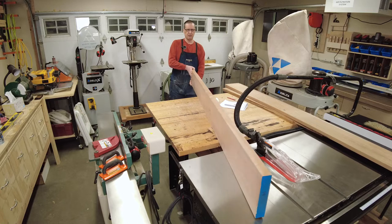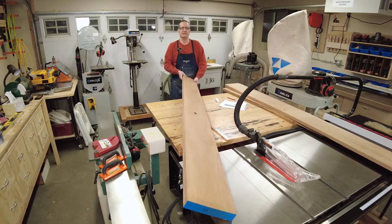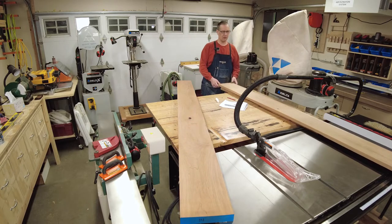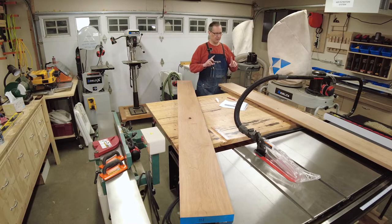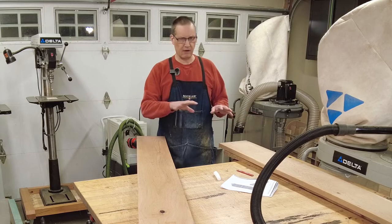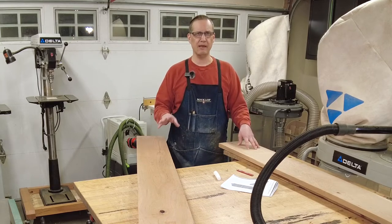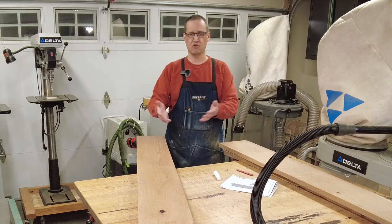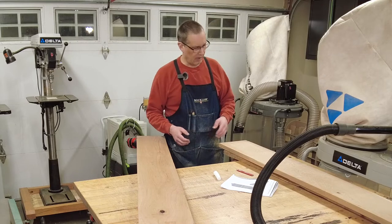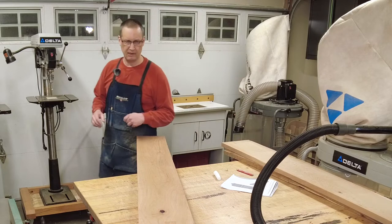This big monster is an inch and three-quarters thick, and that'll be for the four table legs. Then I picked up these two boards — these are five-quarter, and these will be for the top, the sides, and the drawer fronts of the table. I was pretty careful picking these out. The nice thing about pre-dressed lumber — you pay a little more for it, but you see the figure and the grain immediately, and you know exactly what you're buying. I picked out the nicest looking figure I could for the tops, sides, and table legs.